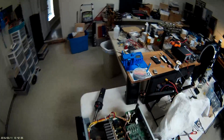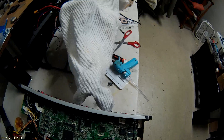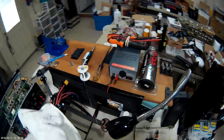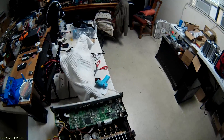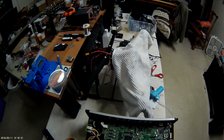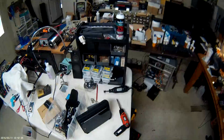What's happening with this unit is the DAC chip — the DTS chip — is actually desoldering itself due to over-regulation problems. The chip is supposed to be running somewhere around 5 to 5.5 volts, but it's running higher than that, possibly up to 6 volts. That's the problem — it's overheating the chip.